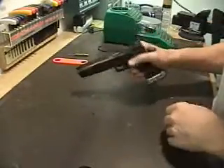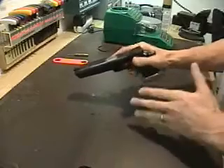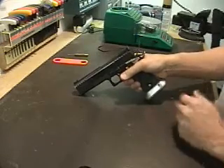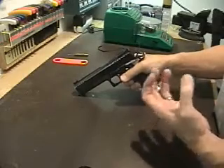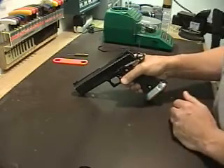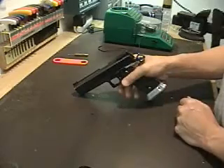For competitive shooting, I make my own ammo. I buy all the components and put them together, tweaking it for my particular gun. For competition, you have to have a minimum power factor — your bullets can't be too light. Once I found a powder, primer, and bullet combination that I liked and that met my minimum power factor, I tweaked the gun to run at that point.